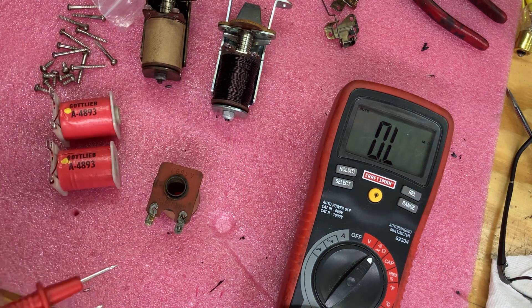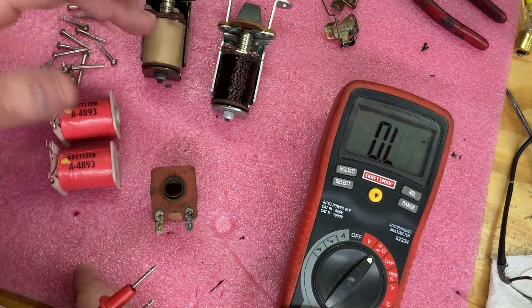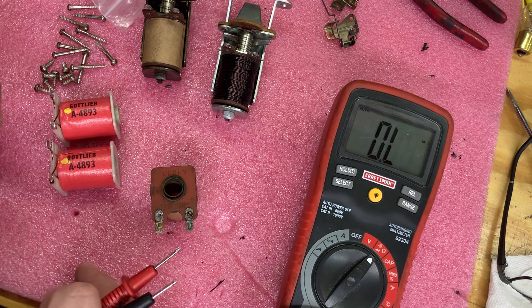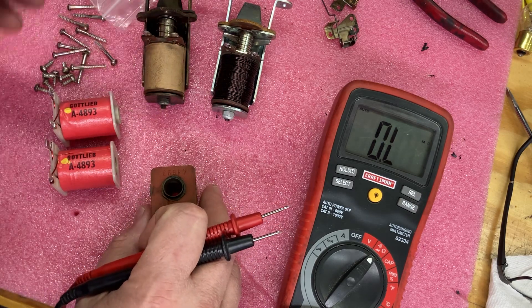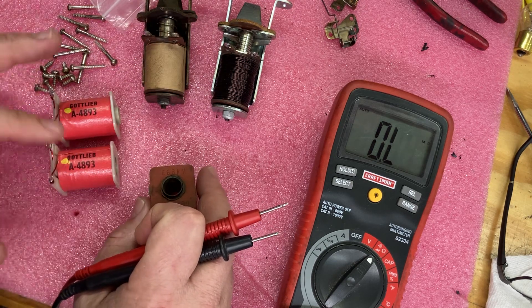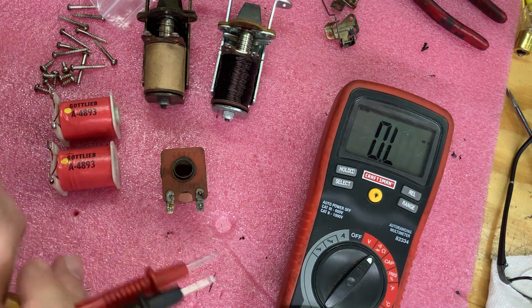From my experience just swapping them out on other games, I could definitely tell a difference. What I've got here — I just thought I'd show this — these are yellow dot coils and these are standard coils, but they're for pop bumpers, not flippers. This is part of the spank ball that I'm working on. As I'm cleaning things up and doing some repair work, I'm going to be putting in these stronger coils. I've already got one of them assembled — it's off the workbench — this is actually the one that came out of it.